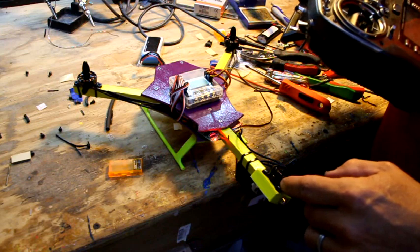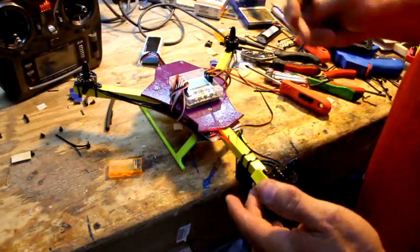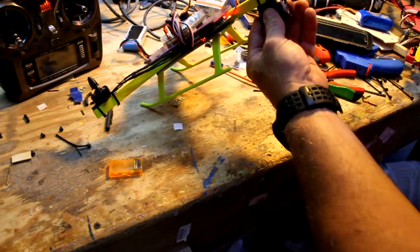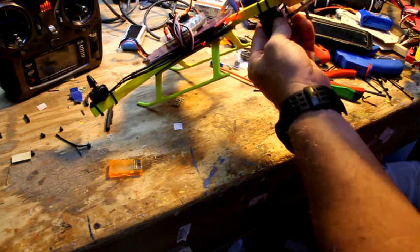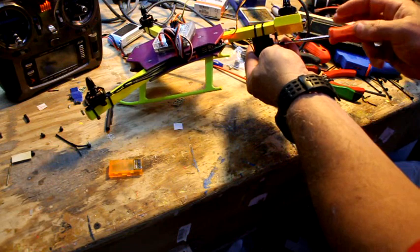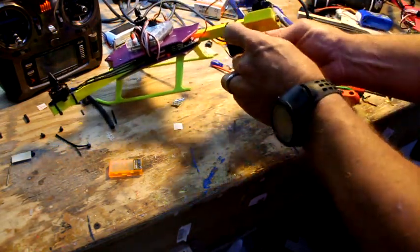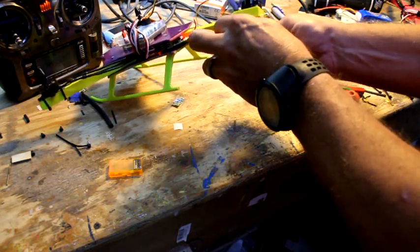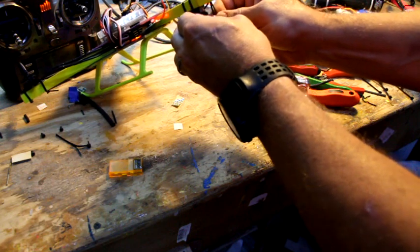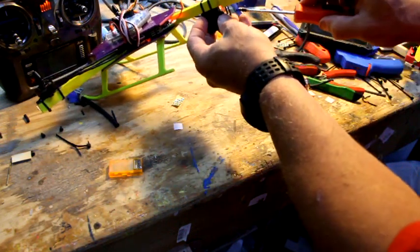One thing you'll notice is that my servo is cocked over to the right. So I really need to go in there and straighten it back out. So I'm going to go ahead and just do that real quick while I've got you on here, and I'll just run my mouth while we're doing that. So my little self-level, or my thoughts that the servo was centered already, end up not being true. So we're just going to take it loose, loosen the screw again, then bring it back up to level, and screw that back in.